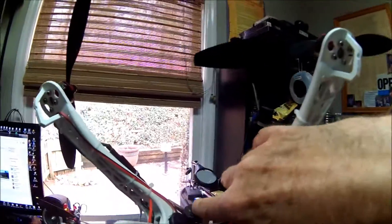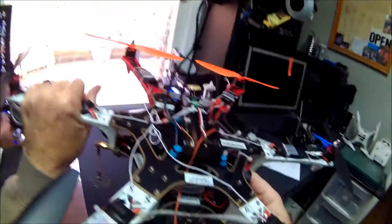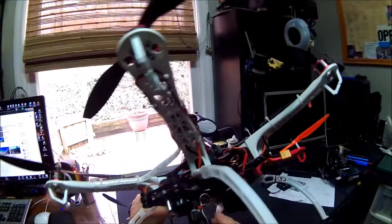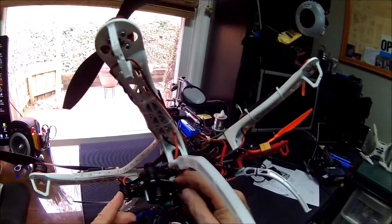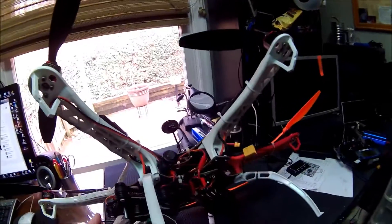There's an extra switch just to kill the nav lights since I don't need them in the daytime. They're just toggle switches hot-glued in place. I put a 1000-microfarad capacitor on the battery rail because the gimbal was acting up — once in a while it would freak out, and the only explanation is voltage spikes on the battery rail, so I put a filter on the supply line.